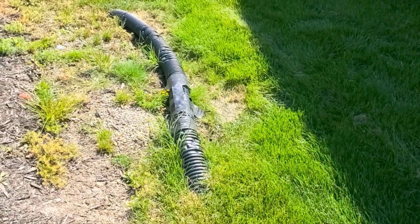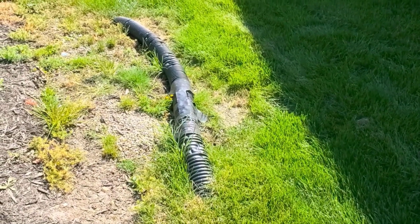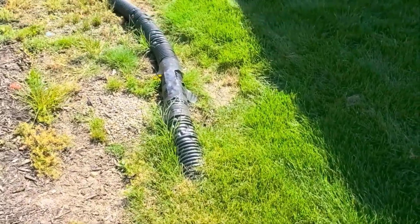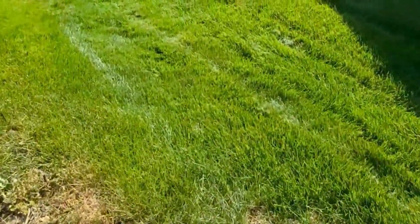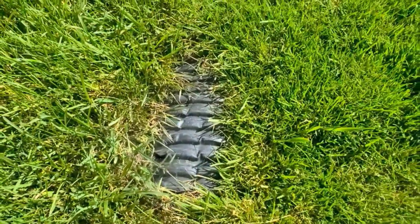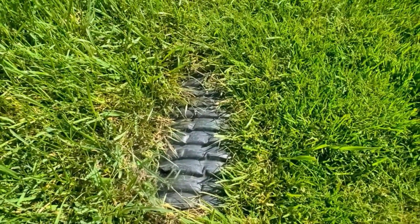In the north, if you don't bury your drain pipe deep enough, this is what happens. This is a job that we're going to redo. When it's hard ground like the clay that we're typically working in — and I know from talking to a lot of our subscribers and people purchasing the Boffman tile we're doing distribution for — there's another look at that pipe surfacing. Each year it's pushed even further up, because the frost gets under these pipes and pushes them up.